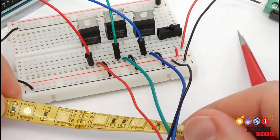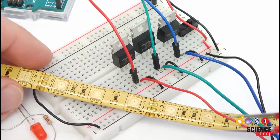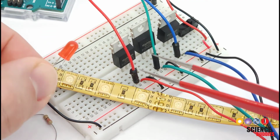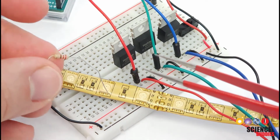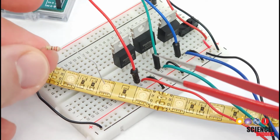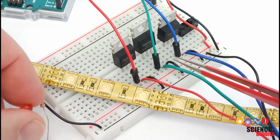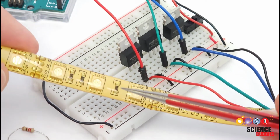So when I fire the Arduino up, it should start fading through different colors like I demonstrated at the beginning of the video. One more quick note about the circuit here. You might be wondering where the resistors are. If you have built circuits before using individual LEDs like this, then you might know that you have to include a current limiting resistor in series with the LED to prevent it from burning out. And if you are not familiar with that, we have a tutorial about it on our channel linked in the description of this video. But you might notice that there are not any resistors included in the circuit I built here. That is because the resistors are actually built into the LED strip.